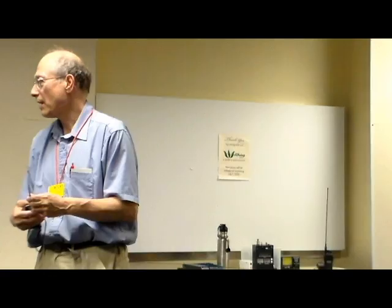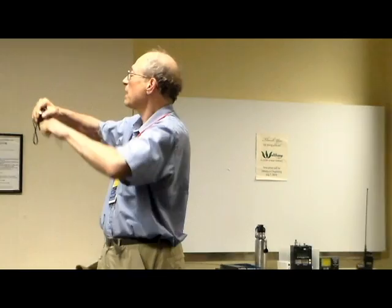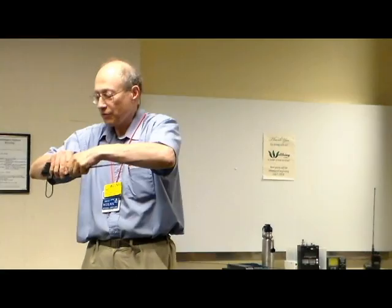Okay. So I have this antenna, and this came with an SMA connector, and SMA connectors are crappy. So I have an adapter with a rubber gasket to a BNC connector over here. And then later on, when David's finished talking, we can come up and look at this stuff and see quick connect. But it's important to give it the quarter turn, otherwise you have an open circuit.